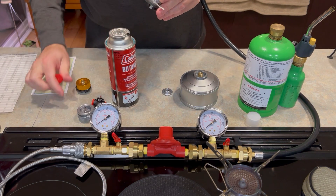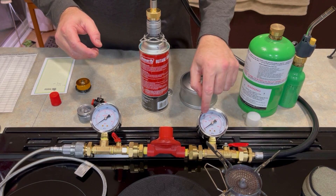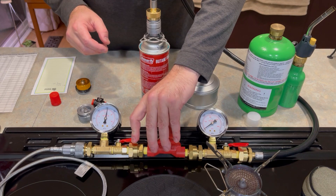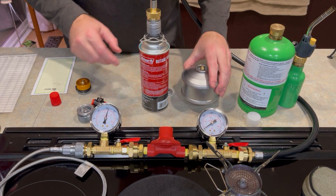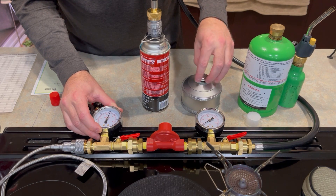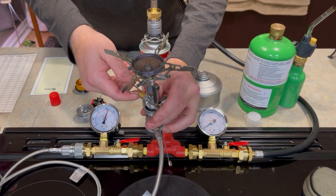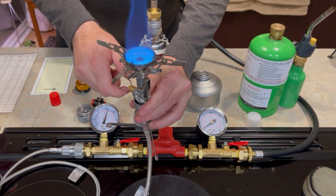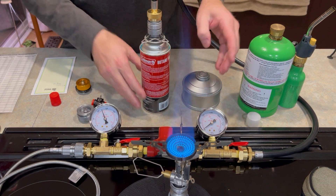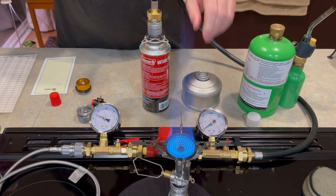This is the warmer container — I'm expecting it to be higher pressure. Quick connect — that's what's really nice about the bayonet connectors. We've opened up the high-pressure side, bringing in gas that's lower than the regulator so it passes through without being encumbered. We're pretty much the same as the other one: 24 PSI, about 157 kilopascals. Very close in terms of pressures. You get a lot better performance out of this thing when you keep the pressure down to what it's expecting. With butane the pressure does go down as you use it, but because propane is so much higher, you don't get that drop in pressure — so that's a nice thing to have.